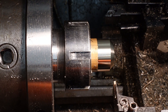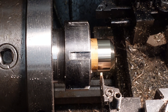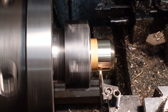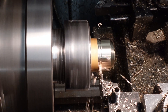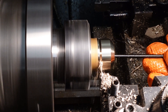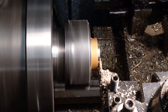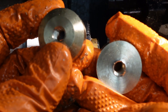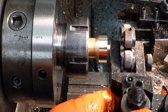I've started using the KGM double-ended parting inserts as I get more repeatable results than with the single-edged ones which clip into parting blades. Cutwell do left and right biased versions which I do find useful, but for general parting off I stick to the KGM style now. I couldn't find my scissor style knurling tool so I had to use this janky pressure knurler, which is pretty dreadful although the knurl wheels are sharp enough.